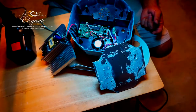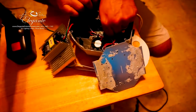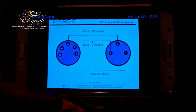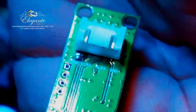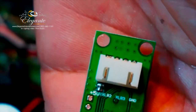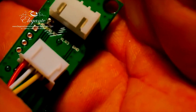Now let's take the other light and find out where the cable has to go. But first, let's remove the LED lights - we don't want these to get damaged, so we'll set those to the side. I'm going to move the DMX cables. Pin one is ground, pin two is data positive, and pin three is data negative. On this particular board you have the designations: five volts on the left, XLR two and XLR three. So pin two goes to XLR two and pin three goes to XLR three. XLR three is yellow, XLR two is white.